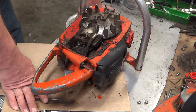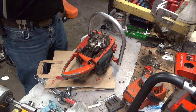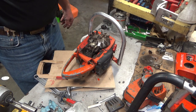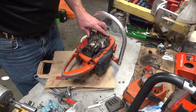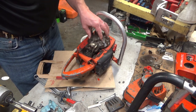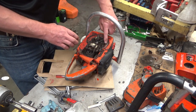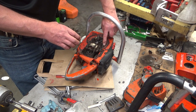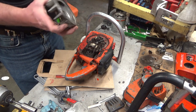In summary, John, we got some really good news here — the engine is not roached. In general folks, if you have a saw that you think seized while you were running it, if you've got the ability to tear it apart a little bit and look for junk like this, it could save you some time and potentially a hassle. These things are known — especially Super XLs — for doing a couple things. Not this necessarily, but backing out a screw up here, especially if you're a late 80s or early 90s model that all of a sudden seizes: look for that screw to have backed out. Some of these missed Loctite, and that can jam up to the back of the flywheel and stop it deader than anything.